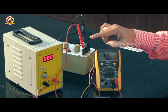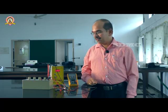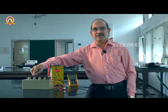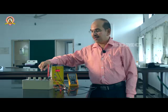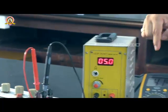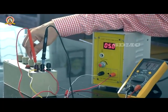In this experiment, the input voltage was changed from 5 volts to 8 volts, but the output remained almost 4-point-something volts throughout. This is how the diode acts as a voltage regulator — irrespective of fluctuations at the input, the output gives an almost constant voltage. This is the stabilizing action of the Zener diode. In the second part of the experiment, the input voltage is kept constant while the load resistor is varied. At input voltage of 5 volts and load resistor of 5 kilo ohms, the output is 4.16 volts. Increasing the load resistance to 6 kilo ohms, the output voltage is 4.19 volts.